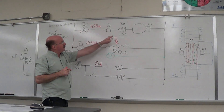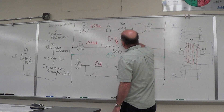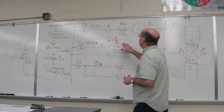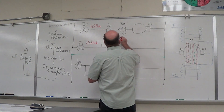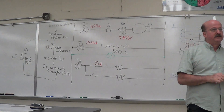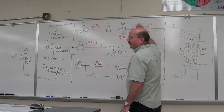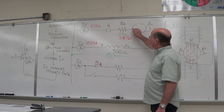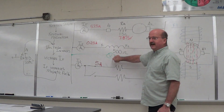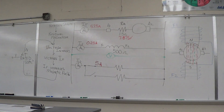Is all that 5.25 amps going through this internal resistor? Yes. So what is the voltage drop across that resistor? 7.875 volts — we have a 7.875-volt drop. If our generator started generating 120-something volts, now we have to subtract 7.875 from it, giving us about 112 volts out.